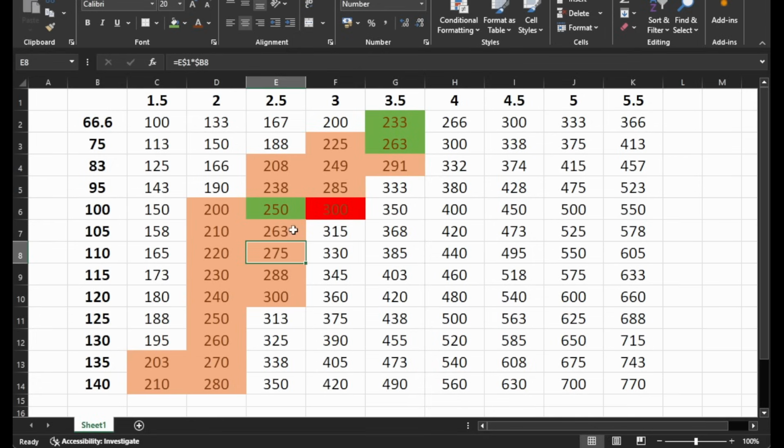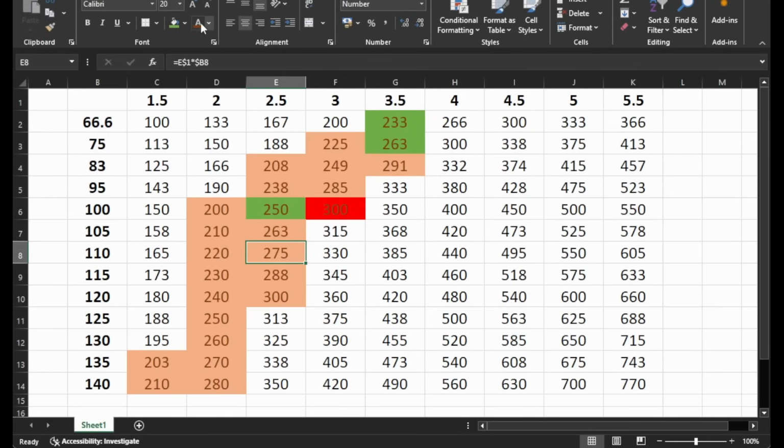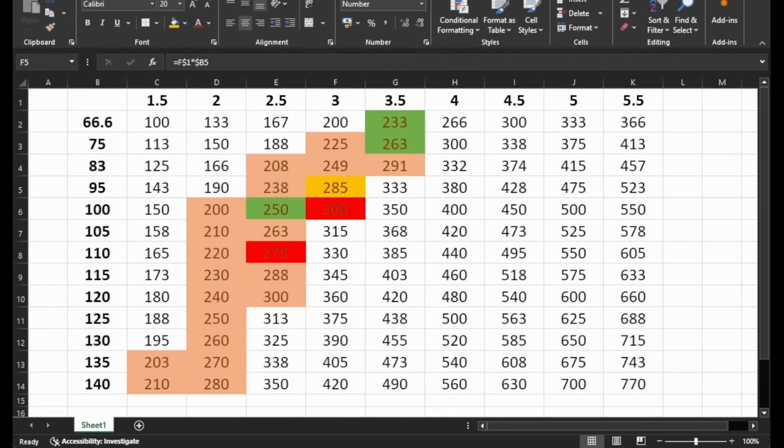I think the memory that I have in there should be capable of running with that speed. So let's do 110 at 2.5. No, it doesn't post. So this one is out. This one doesn't work. So the only other option now would be 95 megahertz frontside bus and a multiplier of 3. And unfortunately, no, it does not post. So yeah, unfortunately, also this one here doesn't work.